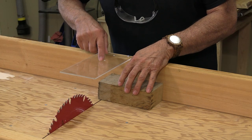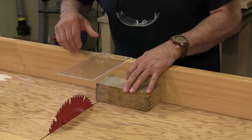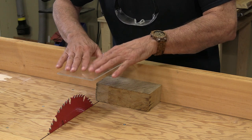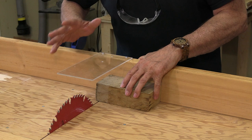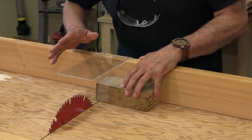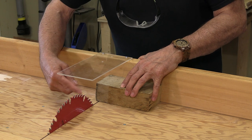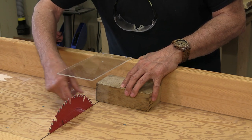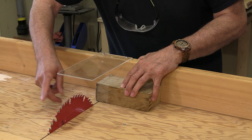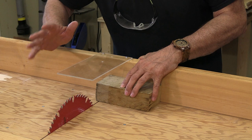Here's a little safety item that I really dislike on these table saw sleds — a little piece of plastic that you put over the top to cover the blade. It looks like a good idea, but here's the problem. I've taught enough courses to know that some new woodworkers, after the blade is turned off and after they've cut a piece of wood, have this need to go in and flick the little pieces out of the way when the blade's still spinning, and it scares me.